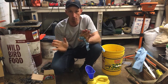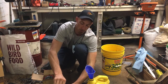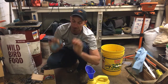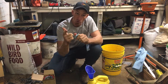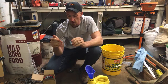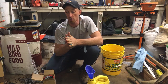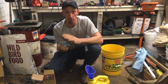I went and bought another one of these filters — they're pricey. I looked everywhere to find a Donaldson because I was worried about a micron difference. I found the NAPA Gold is 12 microns, and people I talked to say they should be damn near the same since it's listed as a direct replacement. Some people preferred the Donaldson, some liked only the John Deere. I appreciate everyone who helped me with this — a lot of this stuff is foreign to me and finding someone with the knowledge who's willing to help isn't always easy. So thank you to anybody who did. I changed the filter and ran the skidder today for a while and it's working fine again.